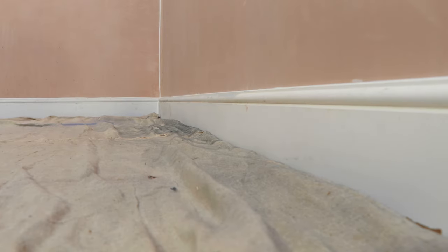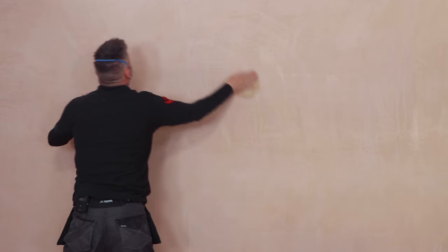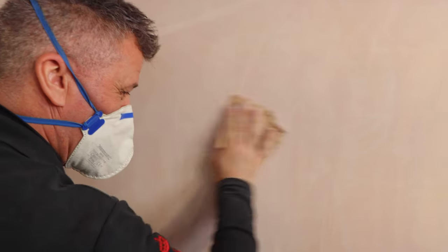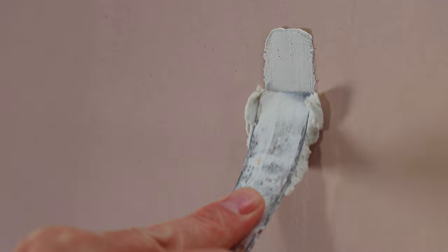Although these are brand new plastered walls, you don't want to paint directly on top of them without a little bit of preparation. I'm using a very light sandpaper, 150 grade, and I'm just gently scoring the surface of the plaster. Because if it's been plastered by a professional, quite often it's like a smooth glass finish and you want it to be a little bit more coarse for your wall chalk paint to bond into it. If you've got any holes in there, fill them with some filler, leave it to dry and sand them down.